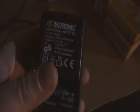Okay, now let's think this through. What you are seeing is my inverter. This inverter works on 250 milliamps and 12 volts. This is a conventional device for charging a battery. So what should I do after 20 charging and discharging procedures? I will hook up this inverter to my battery, which I previously charged with the Bedini, and then to this inverter I hook up this conventional DC charging device and charge my primary battery.